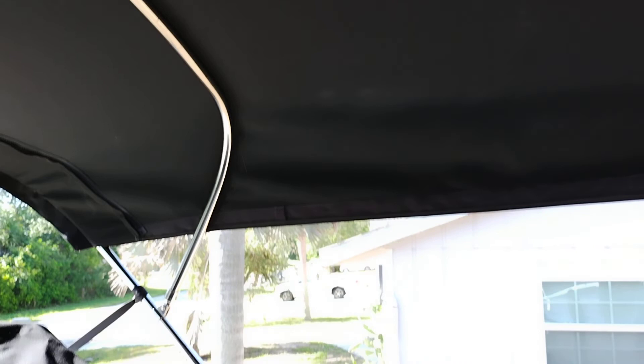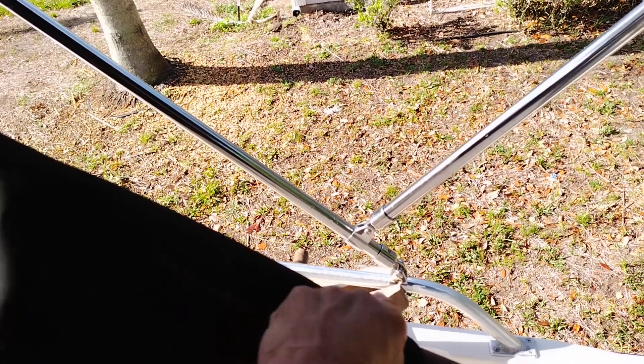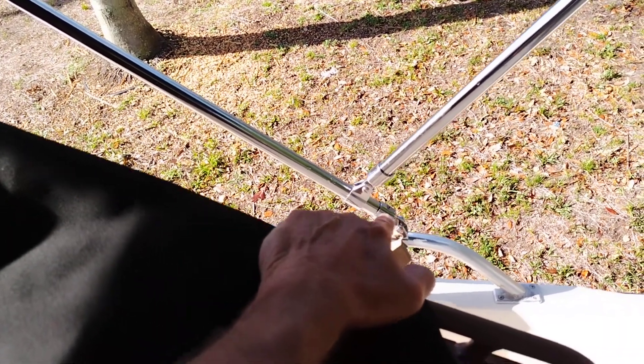We said this span here is eight feet, so in the middle of your eight feet you come down to four feet — that's going to be your hinge point, because you always want your hinge in the middle of your frame. We measured from a point on the rail where this is going to be mounted, and that's your hinge point.